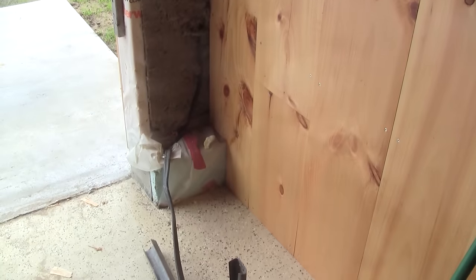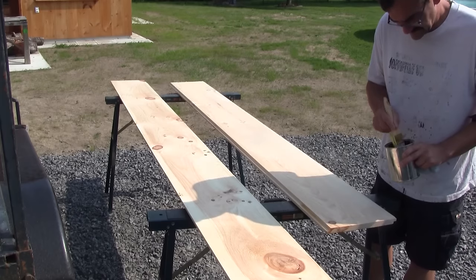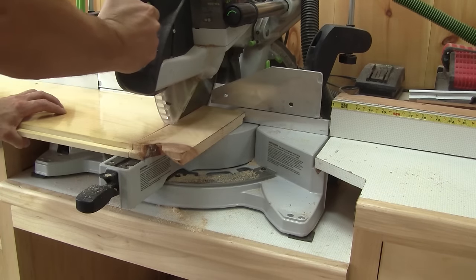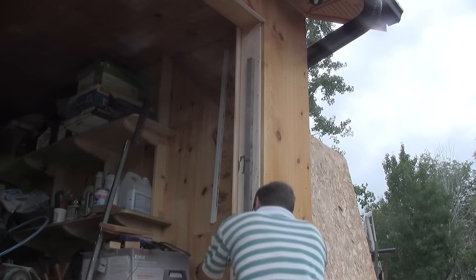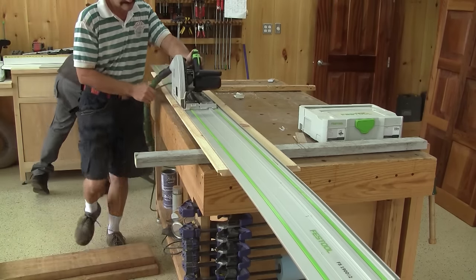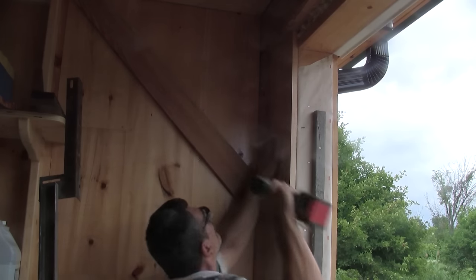But this doesn't help me with the installation of the door. The first thing I have to do is close the wall around the door opening. I start by varnishing two pine lengths just for that. When both coats are dry, I cut them to the right dimensions. Then I put the first one in place and mark its width, and I can rip it to size.